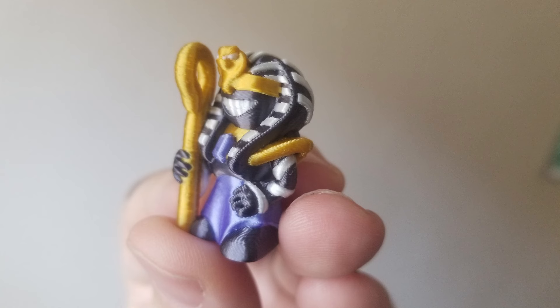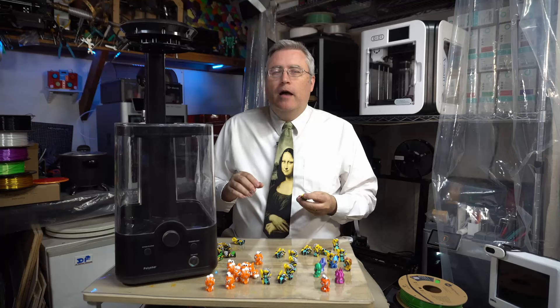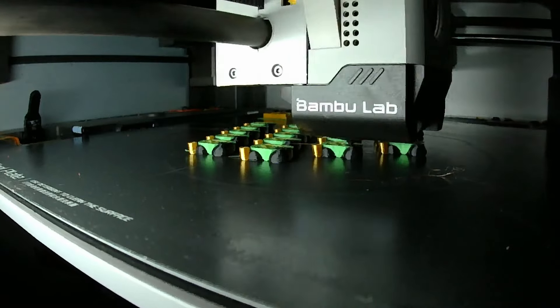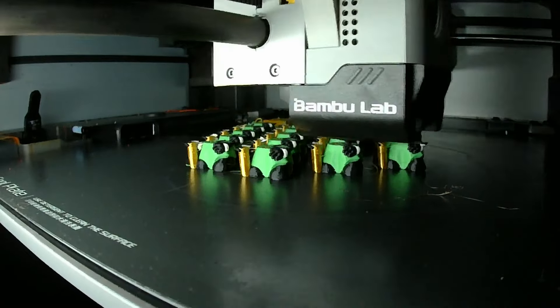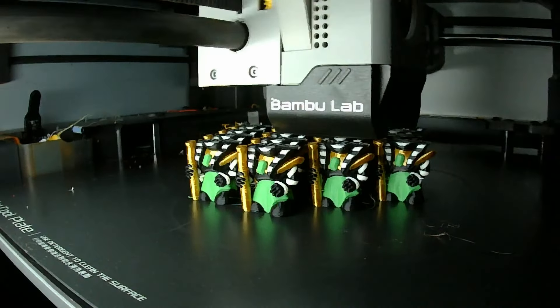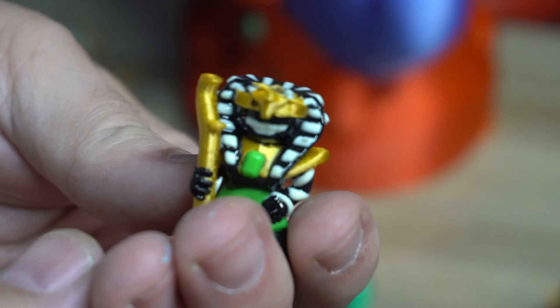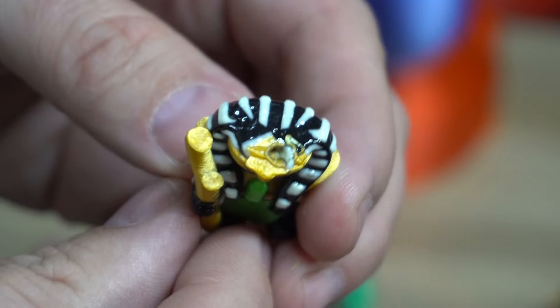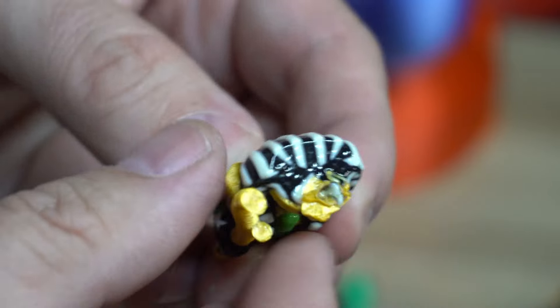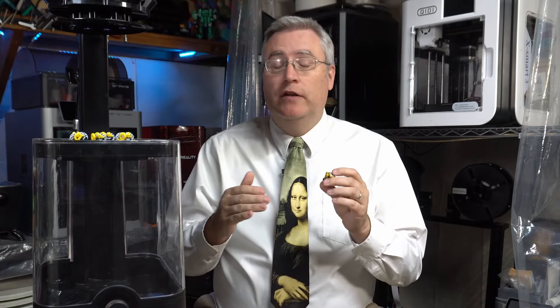There are models like the Nephron Ka model, which I initially planned to have a gold staff and gold shoulder piece — and if I've got to do it in yellow, I guess I've got to do it in yellow. I tried printing a batch of Nephron Ka pieces using Silk PLA in the shoulders, and that print failed entirely. A couple failed a little bit high, I canceled them; then a couple more failed, and then I left it too long and they all just domino-killed each other. You can learn a lot from failure. What I wanted to learn was whether PolySmooth and Silk PLA would stick to each other — and with the entire plate falling apart, obviously that wasn't going to work. It was clearly where the Silk PLA was trying to stick to the PolySmooth that it just wasn't having it.